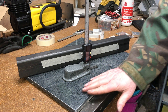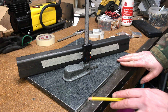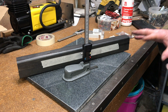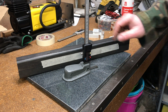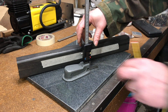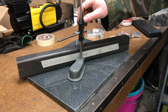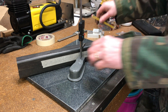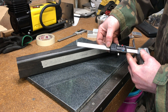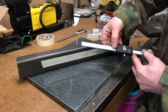You drop it down to your datum line — your base. I use a marble slab we got from Aldi, it's fairly flat, certainly good enough as far as I'm concerned. Drop the vernier down and zero it there, then raise it to confirm the height. We've got 60.16mm, which is what we're expecting — this is 60mm tube. Now I'm going to bring it down to 30mm, give or take a fraction.